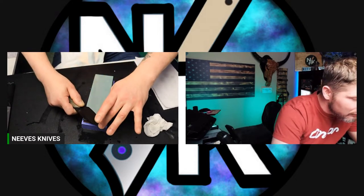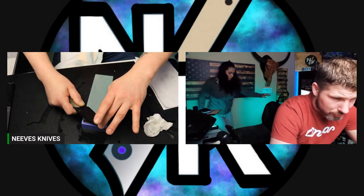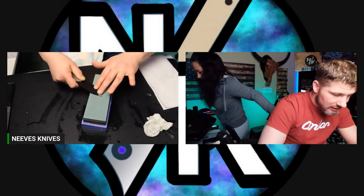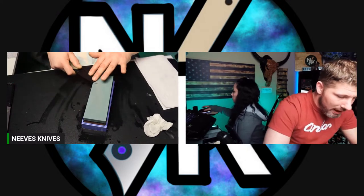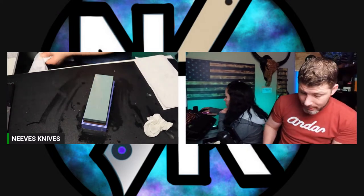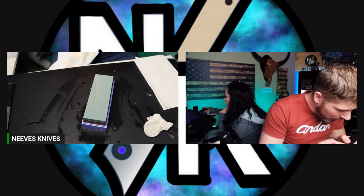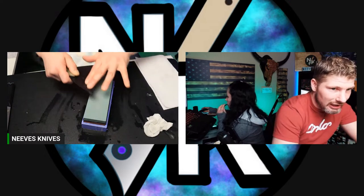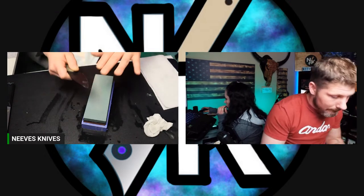Now, if that's very difficult for you to do and you can see that you constantly keep changing angles, then keep it on the stone like this. Keep it on the stone and just go back and forth. A lot of times that'll be easier for a lot of people. It was easier for me. That way you don't have to lift up and you can just keep the angle. You just got to go back and forth with your elbow.